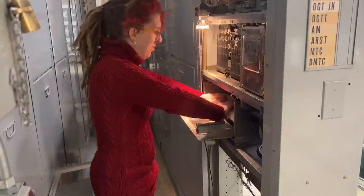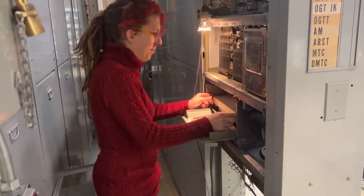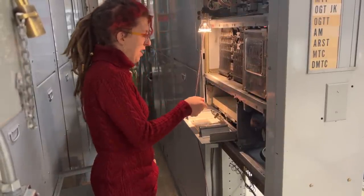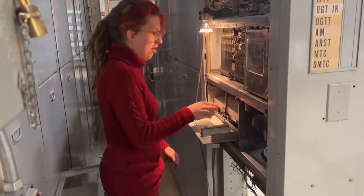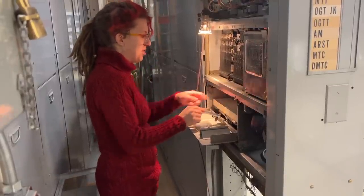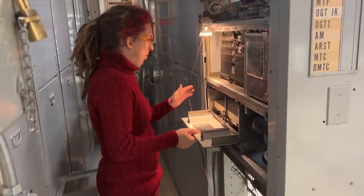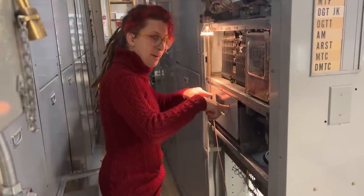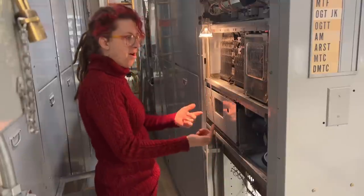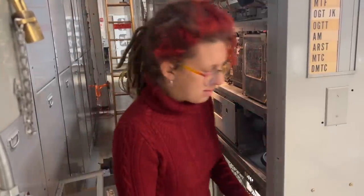So put them on the table. Make sure they're all sort of lined up. And then take this and push it into the cards, because this will actually engage the center notch and then align all the cards left and right. Once the cards are loaded, you can shut the door and then push it downwards. And then the card elevator will launch all the cards up to the ready position.